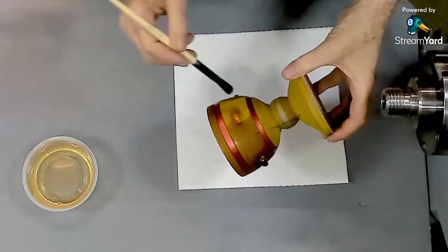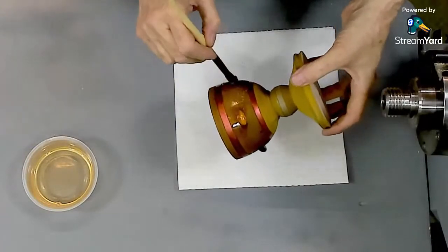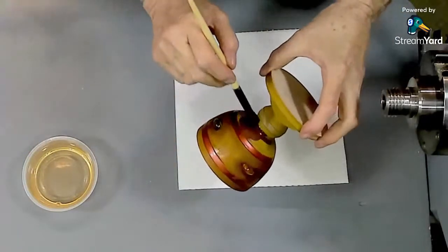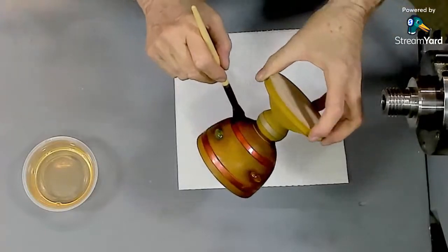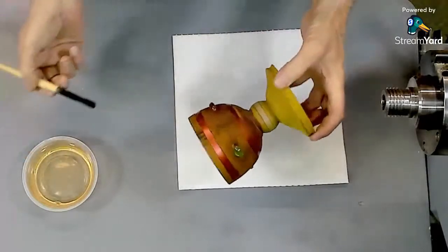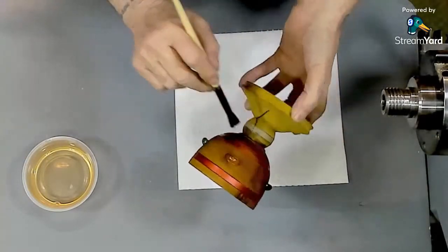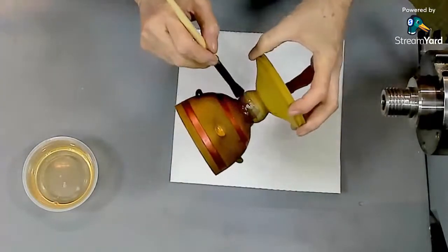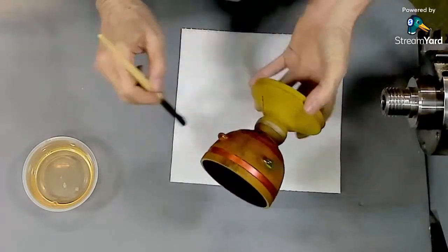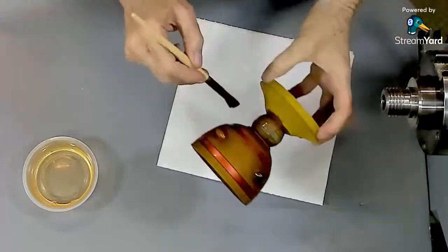So you can see that lemon oil I'm putting on there, that's Chestnut's lemon oil, just because it's a nice light oil, and all I want to do is oil the thing up. And it's making it darken down even. It makes it look more like just a dark wood rather than something that's been coloured. It'll lighten up a bit as it dries, but whenever you put liquid on wood, it will darken a little, no matter what the liquid is.